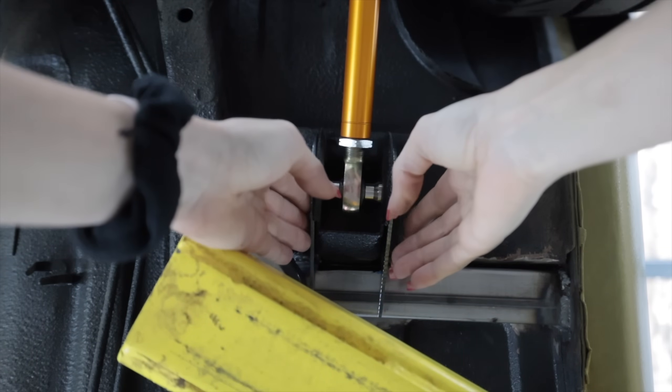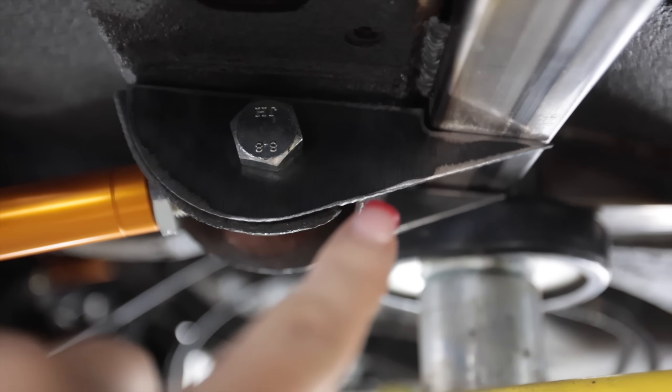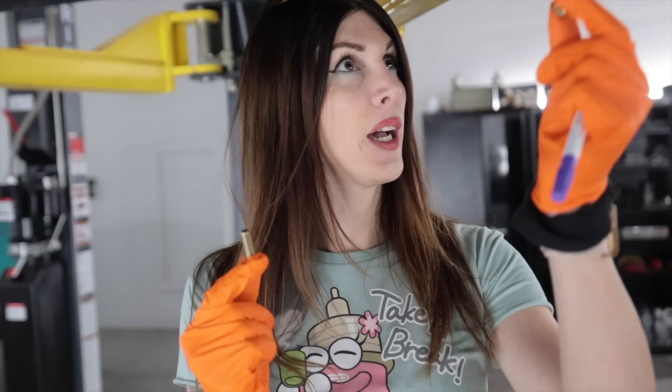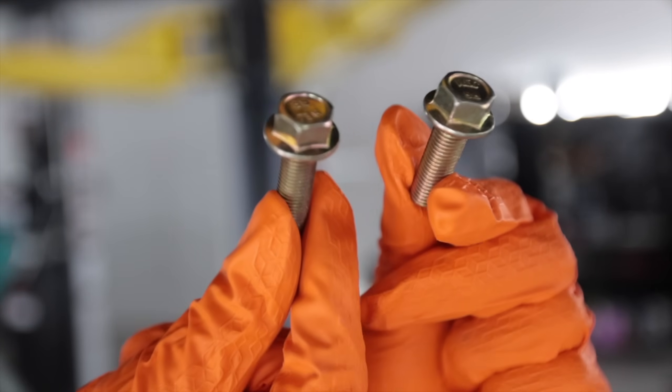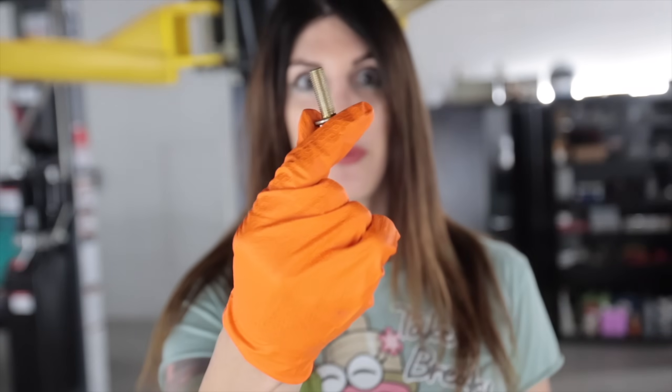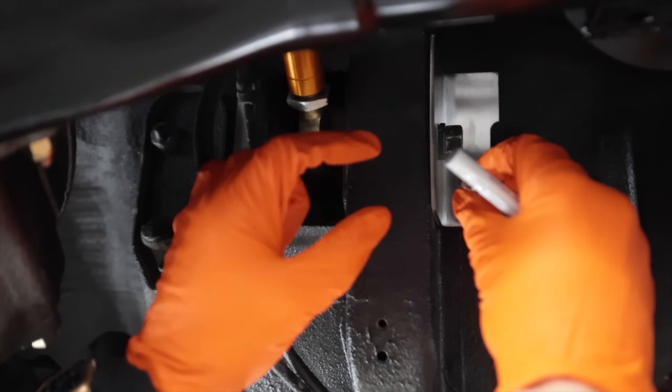Except I'm going to need a longer bolt now, but that gives us plenty of room to run a bead of weld. I'm not an engineer, nor am I that good at math. However, I'm good at looking at what someone else engineered and coming to a conclusion on the strength required. So I'm going to go with four M10 bolts, grade 8.8, to sandwich those two plates together. I don't think it's going to pop four of these. The bolt that goes through the center is an M14, and there's only one of them.